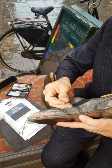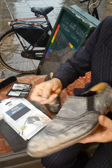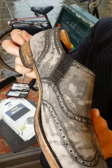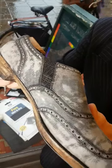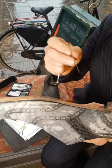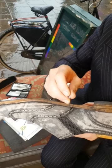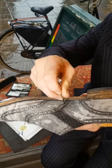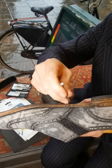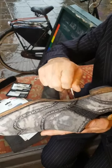I've got a little tiny screwdriver — a set of engineers' screwdrivers. I've carefully selected the correct size; I don't want to be stretching the holes. I've already been through these on this side. The little tiny holes are filled with old polish, so I'm just going to use the screwdrivers to carefully go into each hole and fish out the old residue of polish to make the holes nice and crisp again.